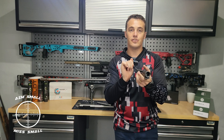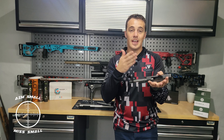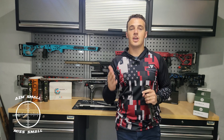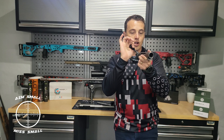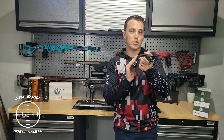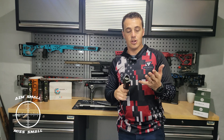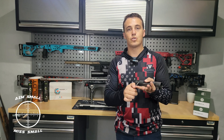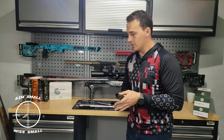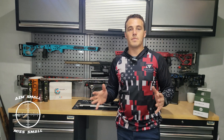There are a few more things that come with it. Smooth operation of the bolt — once it's been blueprinted it's smooth operation forward and backwards. And it goes hand in hand that you have less force required to close and open the bolt. That's important when you shoot a PRS match and you're moving from gong to gong — you want as little force as possible to close the bolt so you can stay on target.